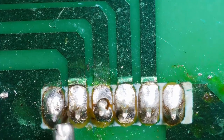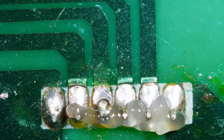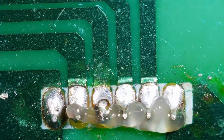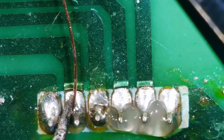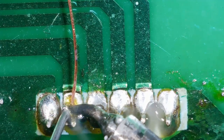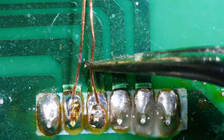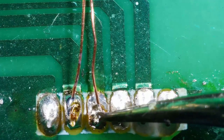Okay, let's do this. Yeah, look at the state of that there — they're all moving. I think this is the right thing to do. A couple of them I think are okay, but I'm just going to run wires from these four, basically, because that's where the creases are. These two ground ones on either side seem to be fine. So I'm just going to run some little thin wires. So I've got these connected to the actual pins rather than the pads, because you can see there that one is no longer connected, and that is why it wasn't working.